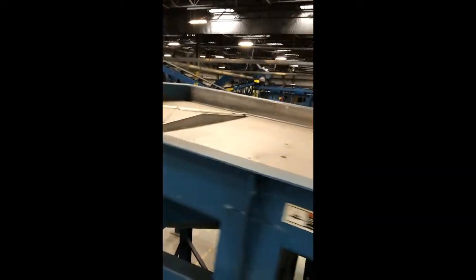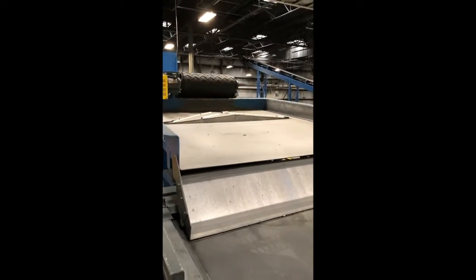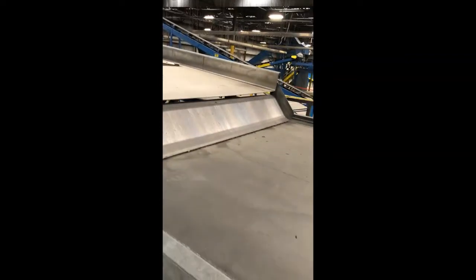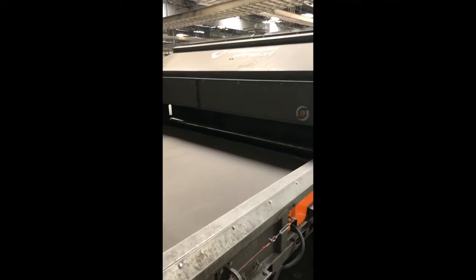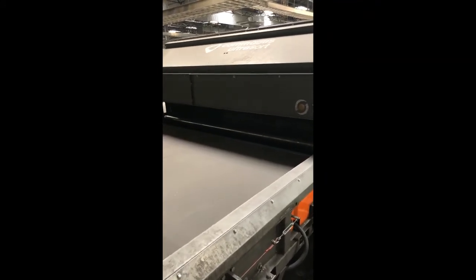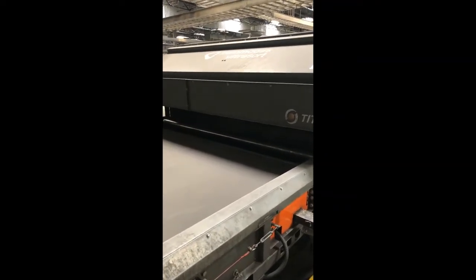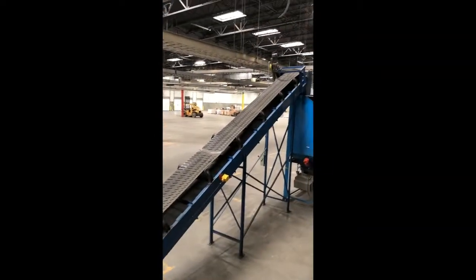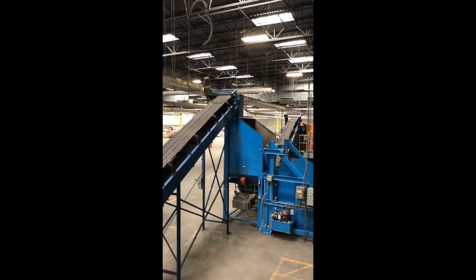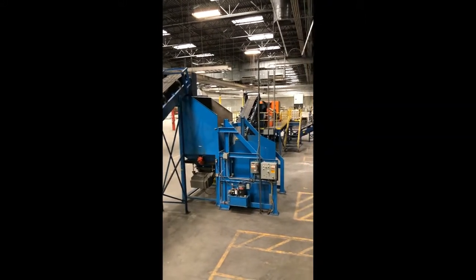There's a large shaker pan conveyor to separate the material, spread it out. Then it hits the Tytech unit, and there's jet nozzles here that pop the metal bearing materials one direction and don't pop the plastic materials. So the metallic or metal bearing particles go up this direction. Again, there's a little bit of a surge hopper there and a box dumper that we can reintroduce materials.